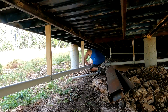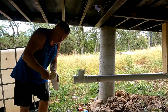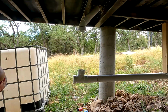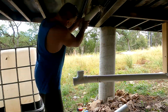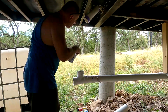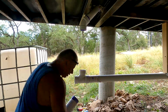Here I'm back continuing the main drain underneath the master, right where I was working with the toilet and the shower area. So I attached those in there, and this is where the toilet is. So making a downspout for that, and making that work out. I know some plumbers actually do a 45-degree angle all the way down this particular slope, but hopefully this will work just fine, and stuff rolls downhill. So anyway, a pretty simple solution there.